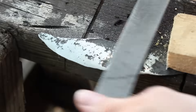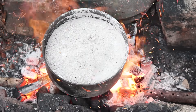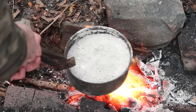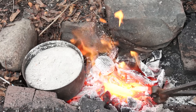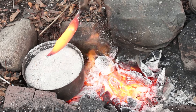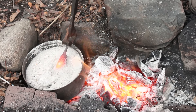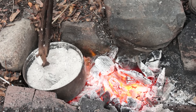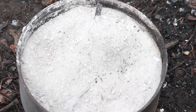To anneal the knife, I took a pot of warm wood ash, warmed it over the forge, while at the same time bringing the blade to a critical temperature to the point where it would not be attracted to a magnet. Then I put the knife into the ash to cool. The warm ash allowed the blade to cool off slowly and in this way left the steel in a softer state, which makes it easier to work with.